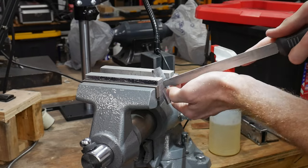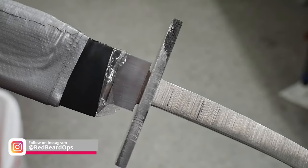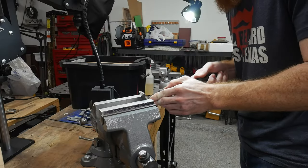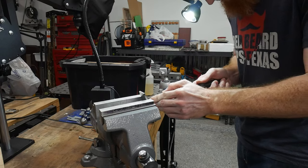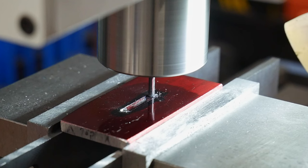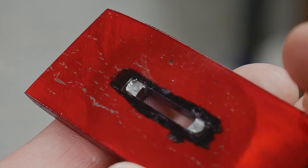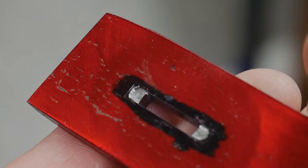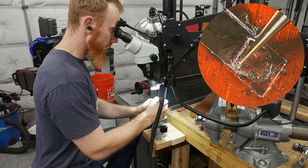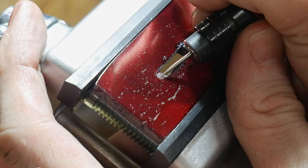The end mill leaves round corners, so it is necessary to use a hand file to square these up. This file has also been ground safe so that it does not remove material on the sides of the slot. Once I have some square corners filed in, I can hammer the guard onto the ricasso, see how far I make it up the tang, remove more material, then repeat the process until I can see a light impression of the ricasso on the face of the guard. Using a small end mill, I removed some of the pocket on the face of the guard, and I continue to remove material with my rotary tool and microscope so that the guard fits up over the ricasso. Vever recently sent me this microscope for review and it's doing a really good job for this task. I haven't gotten this method down perfectly yet, but I do feel like I'm making progress with it. I'm thinking of branching out to a Nick Wheeler style guard fit-up on my next build, just to continue my knife making learning.